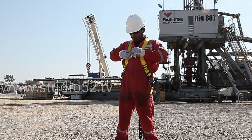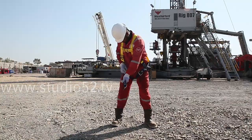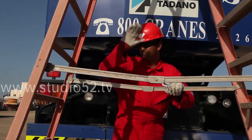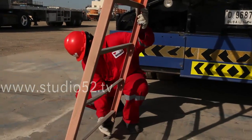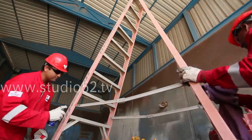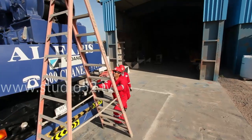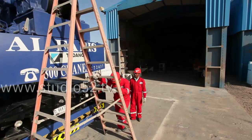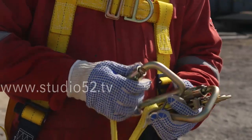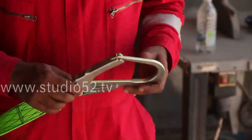When working at height, use correct lanyards — either restraint or fall arresters. If working no higher than six feet from the ground, use a ladder with assistance provided by co-workers. Every time you use a ladder, perform a pre-use check beforehand to make sure it is safe for use. A pre-use check should be carried out by the user at the beginning of the working day and after something has changed. Remember to use only secured and approved anchor points and inspect the PPE being used.